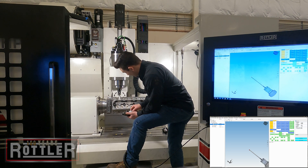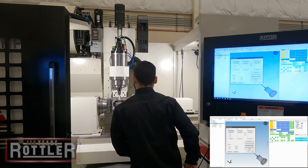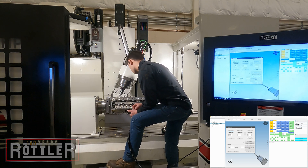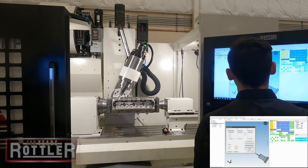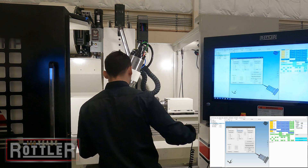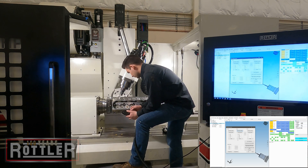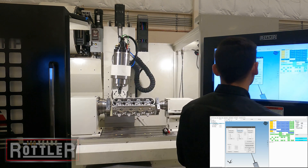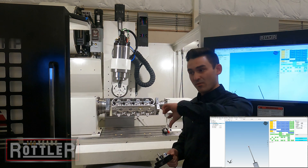On the probe, when it's flashing green that means it's not touching anything; when it flashes red, that means it's just touching — the stylus is deflected. I'll jog just until it's deflected and then add a section, setting the current location because I'm touching. I do the same for the other two positions. I touch the second point, set that as my second, then pick up my third and set the current. I click OK.